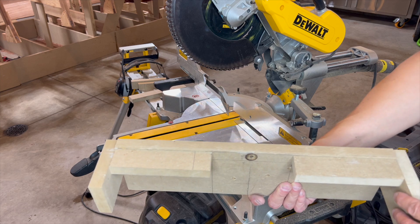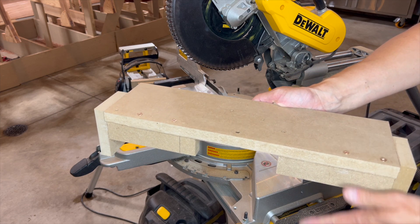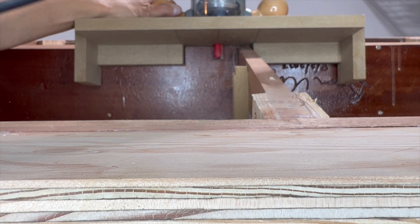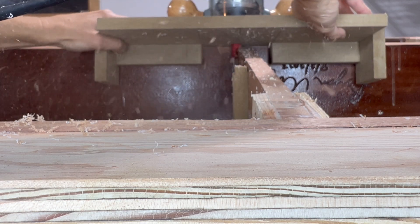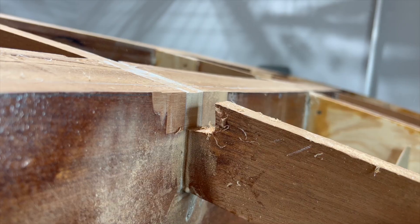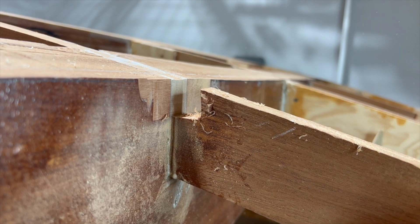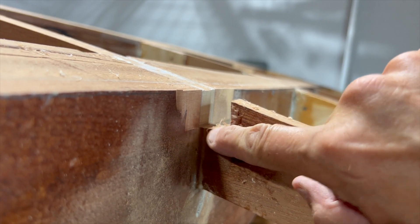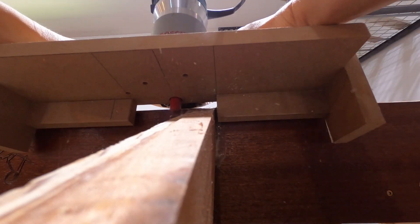While I didn't get everything on camera, I added side rails to this jig so that when I put it against the stringer or keel I have a better chance of holding it flat. It looks like my jig worked pretty well to cut out the flush part of the limber holes. I'm going to use this jig to cut the holes on the outside of each stringer and the keel, and then use a round bit to cut it further. First test run works pretty well.